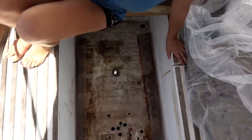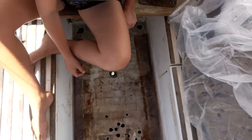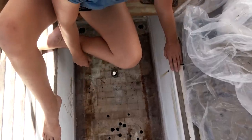So we laid up two strips of fiberglass on each side because we had cracking in the bond between the sides and the sole. We're just trying to give it a little bit of extra strength there, bonding the bottom to the sides of the cockpit before we put our core in, because that's going to be decently heavy.